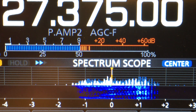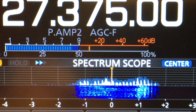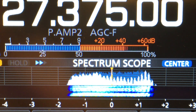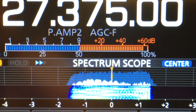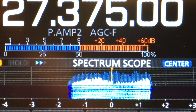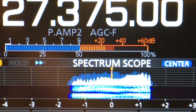So the higher you go the more gain you get but you lose directivity. In theory the most you can get is 3 dB gain on the stack - that's assuming everything is perfect. People say you can get about 2.7 to 2.8, but 3 dB is the ideal.